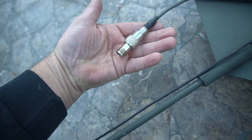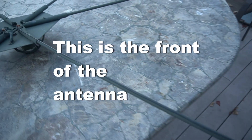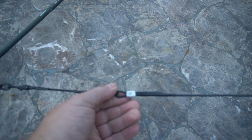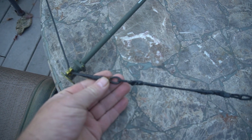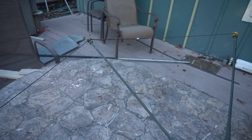I've got a feed line with a barrel connector to hook to the other coax that goes to the radio. On a hex beam, the wire does not go across. What it does is go down — this is half of your dipole, and there's the other half that goes the other way. They come down to this point where there's a loop in it, and then a special size space that goes from here to the reflector. The reflector goes all the way around, to there, to there, over to there, and then right there, just like the other side.